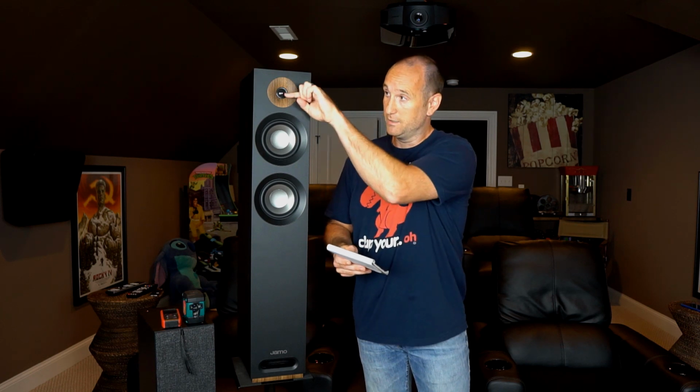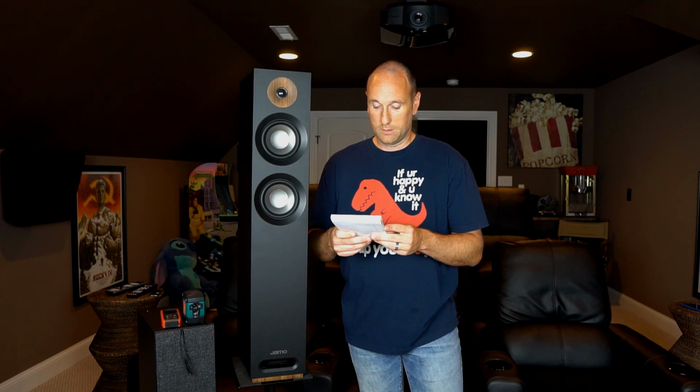These are some of the notes that I wrote down. I said Jamo S807 at the tweeter axis, which is with my ears at the level of the tweeter. I played Rage Against the Machine's Know Your Enemy, and I said nice kick, but anemic at louder volumes, compressed or high Q roll off. The data turns out to show that it is both of those things. I played Joan Jett's Heartbreaker, and I said biting at mid-highs, 1 to 2 kilohertz, with a question mark. I said punchy bass, but not full, at around 120 hertz. I heard that, and the data also backs that up, and I'll get to that.